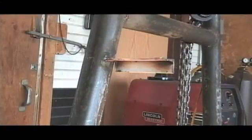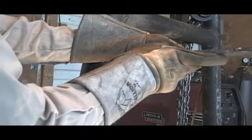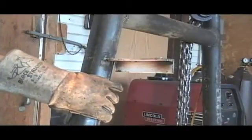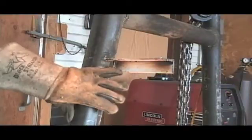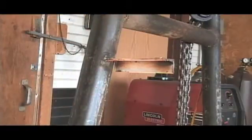For the overhead test specimen, you want to make sure that nothing is hindering your hands from going into the material as you weld, and you want to get comfortable. I'm going to lean on the leg of this A-frame here in my shop. I've gone to the point of using a 2x4 at times out on a job, or looked for some piece of iron to brace myself just to get comfortable in the test booth — and sometimes it's very difficult to get comfortable.